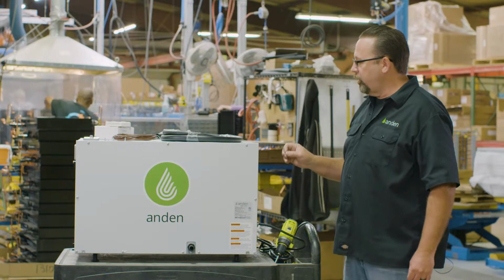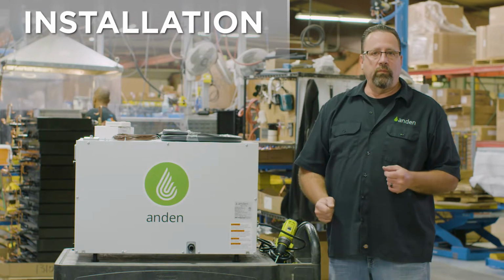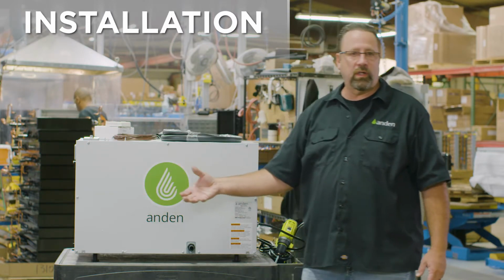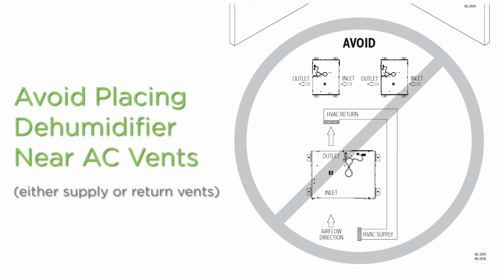When installing the unit, we want to take into consideration where the inlet air is coming from and where the discharge air is going. So we want to make sure if you're hanging this unit that we are not having one unit blowing warm, dry air into another unit. We want to make sure that the air coming into the dehumidifier, coming in through that filter, is the wettest air in the space, so we can squeeze the moisture out of it. So don't have one unit pointing at another unit, keep them spaced out evenly. Don't have an air conditioner duct blowing cold air out of the supply register into the inlet. It doesn't do any good to have cold, dry air going into the dehumidifier. We want wet air going into the dehumidifier.